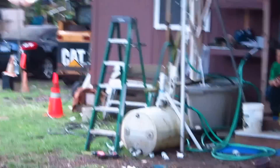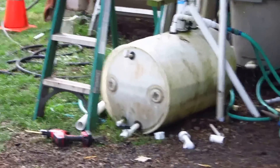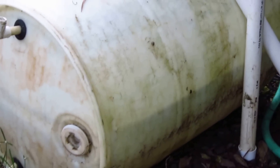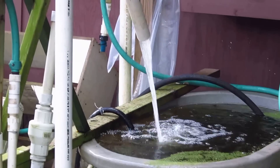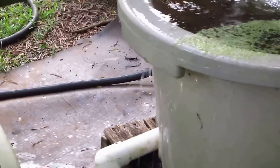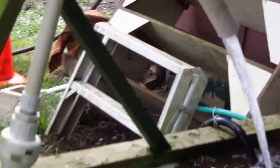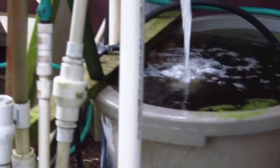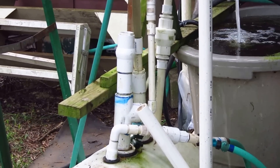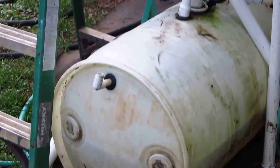So here we are coming over to Miss Natalie. We're going through the one-inch — oh, we have a little overflow situation. Notice the 55-gallon drum is about half empty right now — about here, see? It's about half empty. We'll just let it overflow; it needs a little change out. That's our test tank. It filled up this 55-gallon with a check valve down there, filled all the way to the top, and we're timing how long it takes to empty. About two minutes right now, so we're over halfway through. About four minutes to pump out a 55-gallon drum.